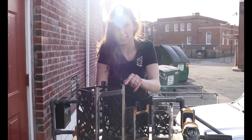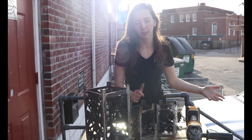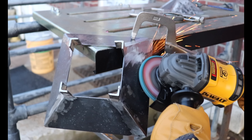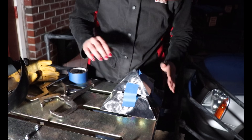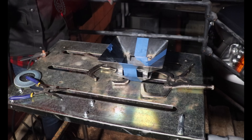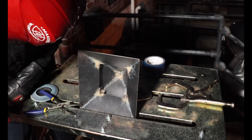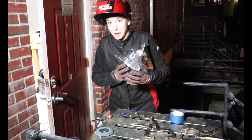If there's any wonkiness with these it's not that big of a deal because they're not going to be visible, so I'm going to move on. I'm going to assemble all of the roofs separately and then the very last step is putting the base and the roofs together. The bottom roof section also needed angle iron before it was ready to be welded to the very top piece. I used painters tape to help perch these together how I wanted them to make it easier to place the tacks. I tacked from the outside so I could visually get things exactly how I wanted, and then ran my full beads from the inside where it was easier to access things. I've got a roof!